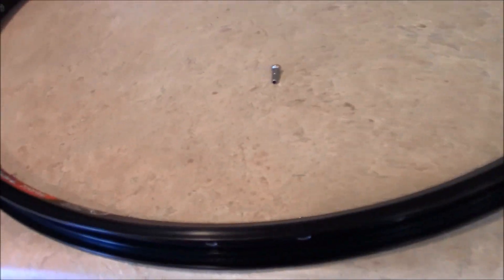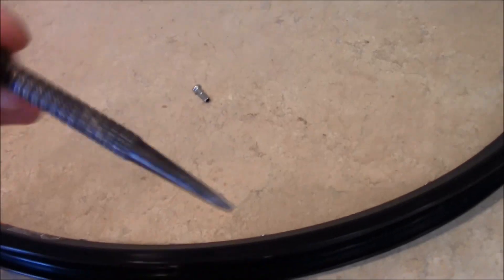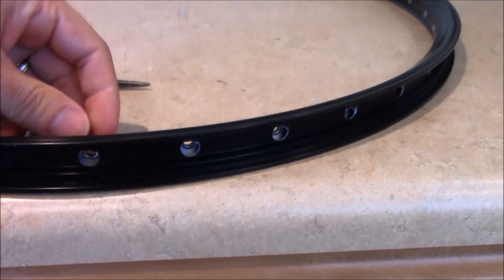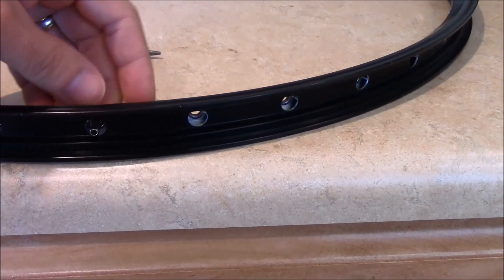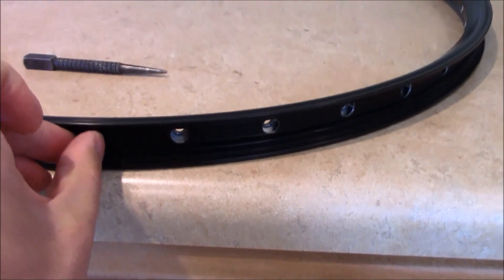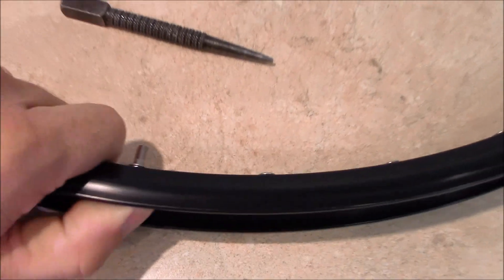What I've done, so I don't have to drill these out, I've used a punch to basically slide into the hole and just kind of wallow it out and just expand the hole a little bit, which I think will be fine. I've got one here that's finished. I just wanted to do a test fit before I did this, and it's good to go. Pops out and everything's still there — the ring, everything.